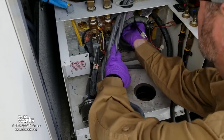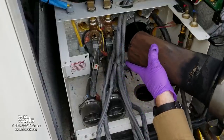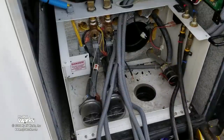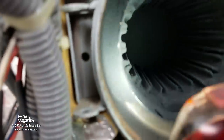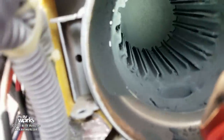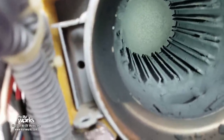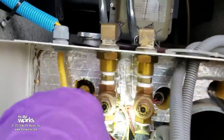We're going to reach in and pull out the burn chamber. We've got some buildup on that. Let me bring it out into the yard and take my flashlight and look inside. I just pulled out the burn chamber and the inside looks okay. I have done jobs where that chamber is just filled with soot — insanely nasty. But the flame shoots around all those areas, heating them — that creates your heat exchanger.